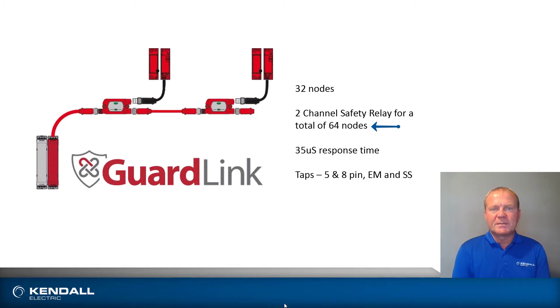There is also the possibility of taking that second channel and configuring it for a light curtain, an e-stop, or any regular safety device — so you could add a separate global e-stop alongside the GuardLink channel. If you're familiar with SensiGuard wired in series, every additional SensiGuard sensor would add 18 milliseconds, making your response time slower and slower as you added more devices. With GuardLink, there is an adder for response time per tap, but it's only 35 microseconds — greatly reducing response time compared to SensiGuard in series.